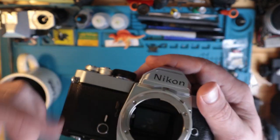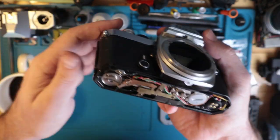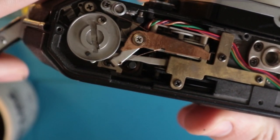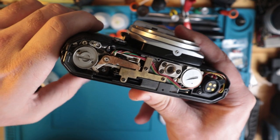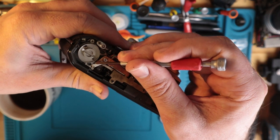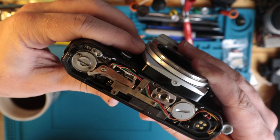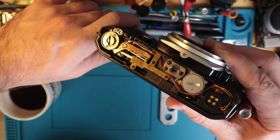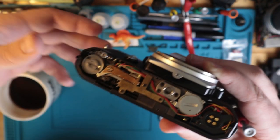That causes a chain of reactions through the rest of the camera, mostly in here, so you can't really see it because the shutter release mechanism is in there somewhere. The thing I want you to pay attention to is this system right there. Notice how it falls into place — that catch was not working. What that does is it locks the advance lever basically, so if I were to move it slightly, there's a little lip there on that arm that will move, but that stays there and catches it. Now notice this brass piece here folds into place, putting pressure on this little arm.